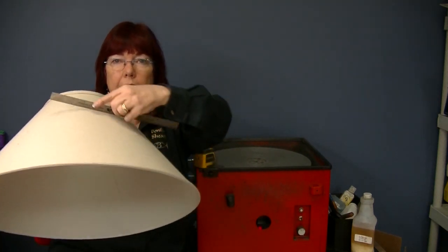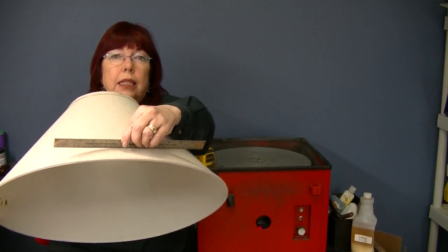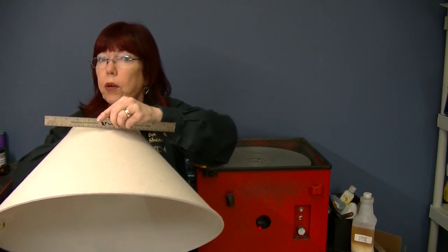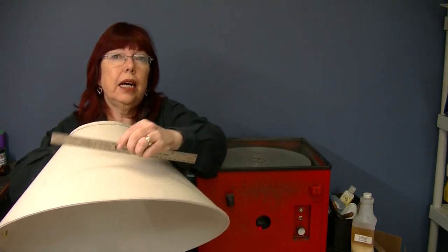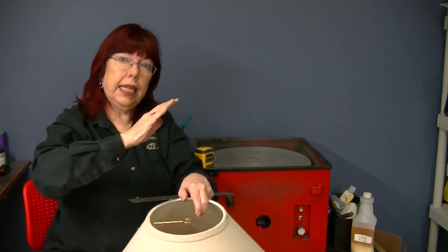Can you see how the hollow will vary depending on whether you're toward the center or toward the outside? If you need a blade with less hollow, you'll want to do more of your sharpening toward the outside. If you want more of a concave or hollow, you'll do more sharpening toward the center. There's an area some sharpeners call a 'sweet spot' — it's a little controversial — where you'll have the most correct hollow. The hollow, from what I understand, is about 57 microns — basically about the width of a hair on your head.